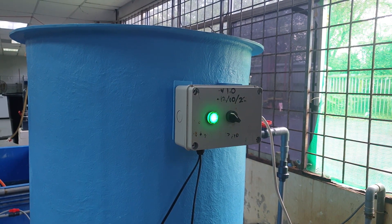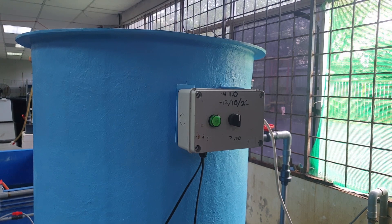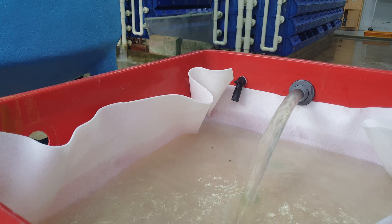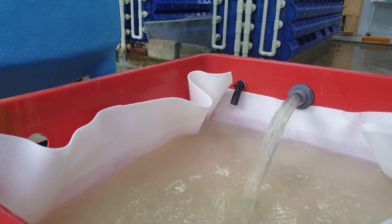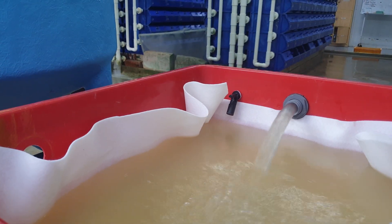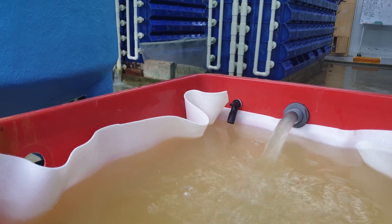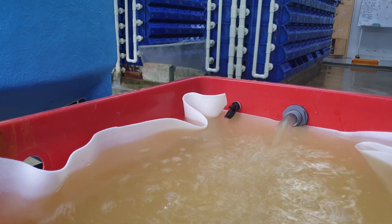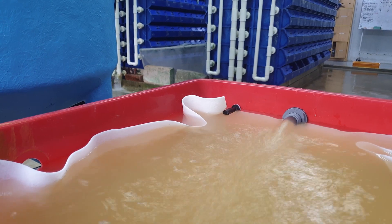What is behind all of this is a circuit that controls all the functions throughout the opening and closing of the ball valve and ensuring no overflow occurs in the tray. One typical problem you might have is sometimes the tray might get plugged up over some times of usage, and you can see the water level keeps rising and the valve is not controlled. So what tends to happen — as you can see fast forwarded — as the water level rises and it triggers the level switch, it quickly cuts off the ball valve to ensure there is no more water coming to the drip tray. This is to prevent overflowing of sludge inside the system, especially if you were to automate the system.